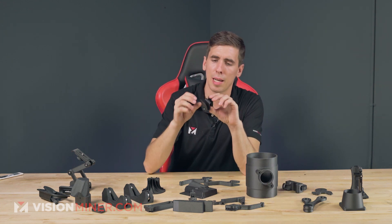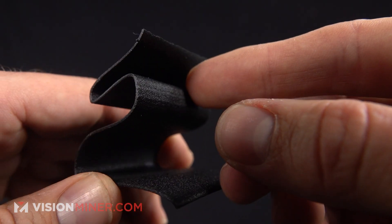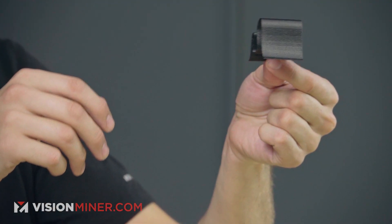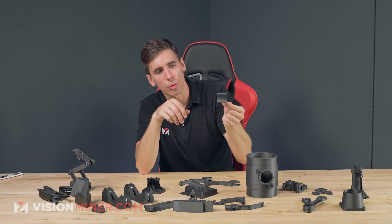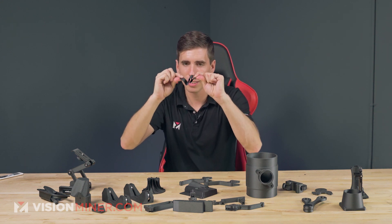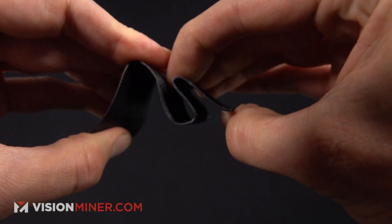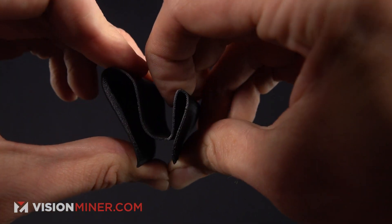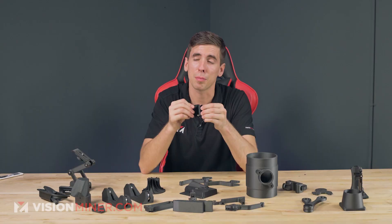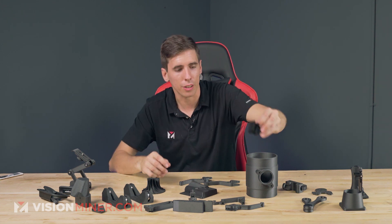Here's an interesting example. I actually made this — I just made a little sketch in Illustrator and then turned it into an STL and extruded it up. It's like a clip that I can put onto a whiteboard and hold the Expo pens right in there. It's just a little flexy — a cool little thing. It's strong. I did it because I know CF nylon would be easy, stiff and strong, but still have some flexibility and toughness so it wouldn't crack or break or shatter.